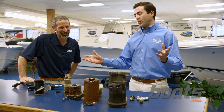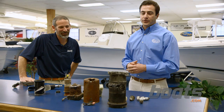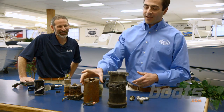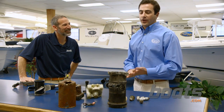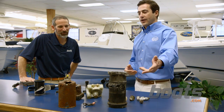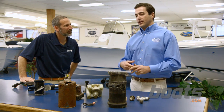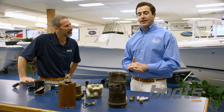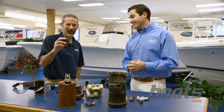There's a wide array of outboard-powered stuff here — some fuel filters that have not passed the test of time. Folks have had running issues; these should be changed at least every hundred hours, some say fifty. There are some exhaust tuners that have rotted out from not using motor flushers, rectifier regulators, and some trim and tilt assemblies that have just rusted out. Proper boat maintenance is essential to optimal performance.